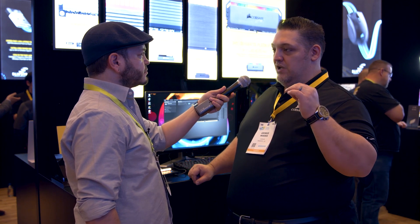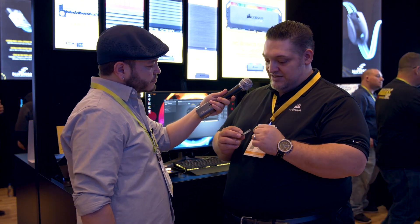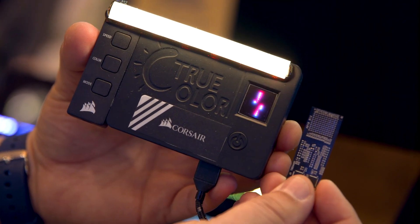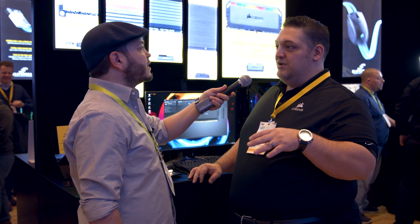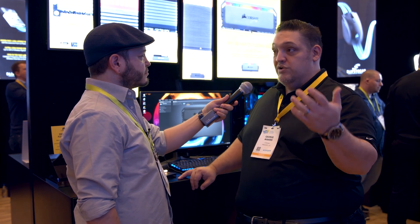That allows you to save about 90% of the space, so it's literally a tenth as large. For example, here is a version that has 132 LEDs — all those little dots are individual LEDs. And here's an example that has a kind of pseudo dot matrix display — it looks like a little mini screen. The benefit isn't just that you can fit more LEDs in the same space; because you're not having the solder points and you're mounting directly to the substrate, you save so much power, you're saving heat, using less power. And the lens not being there gives you significantly more brightness. In terms of lumens per watt, this is way more effective — you can get tons of light out of the same level of power, or reduce the power significantly at the same level of light.